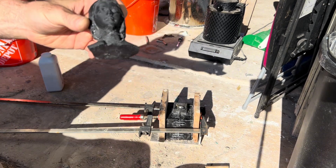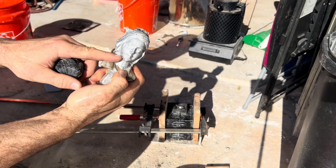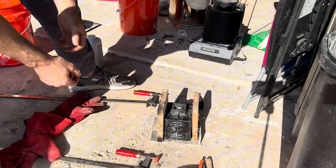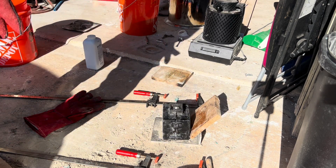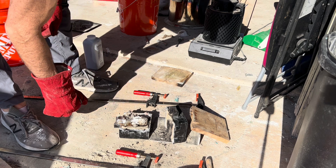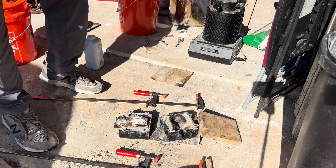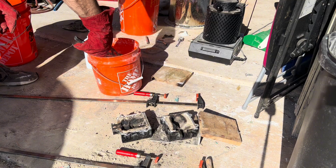We took this PLA mold — one I had printed off before. I didn't have it exactly sealed up, but we got the face pretty good. A lot of this I can clean up. The problem with sand casting is you'll often get pitting. Let's see how this one turned out — we've got the face pretty good. You can still see the face detail. There's a little leakage, which I thought I might get, but not as much as I worried about. Let's quench this sucker. Not too bad.